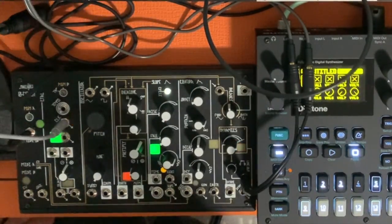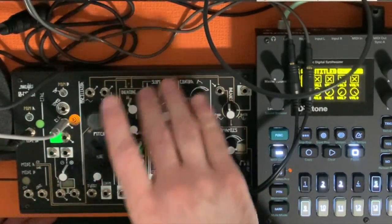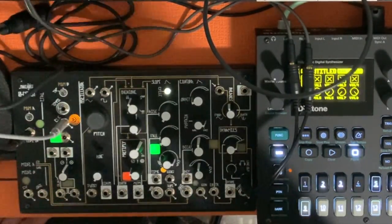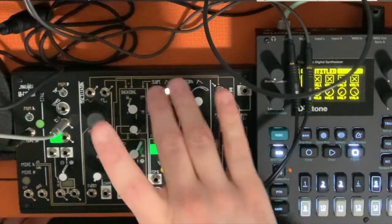We saw there, there is actually some tuning you can do to sync up the oscillator and the slope LFO, the audio rate LFO, so that you can get some paraphony in the output. All right, so even though it's just a monophonic voice, you can sort of fake additional voices with the slope and contour circuits.